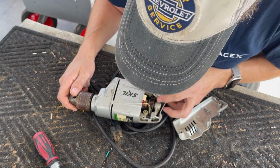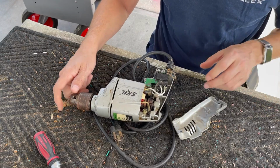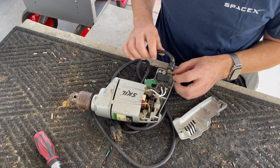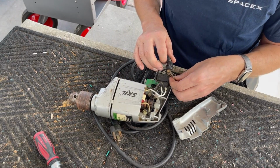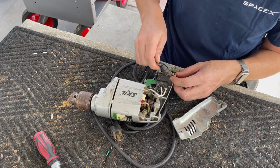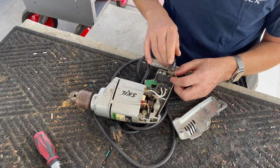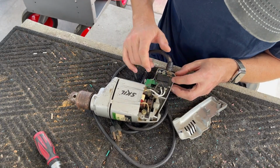The brushes. Yeah, the brushes are okay. They're not too worn. This is not good, this cable. So, it's not even good up here. It's very dry. I don't see where it's cracked, but it's very dry. But interestingly, I don't see where he got a shock through the body. I don't see that. Because everything seems fine.